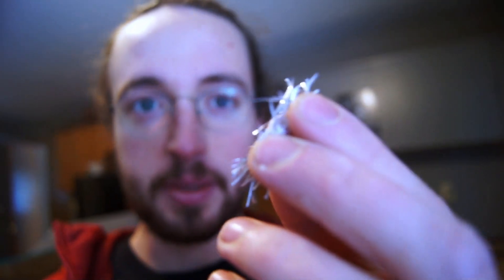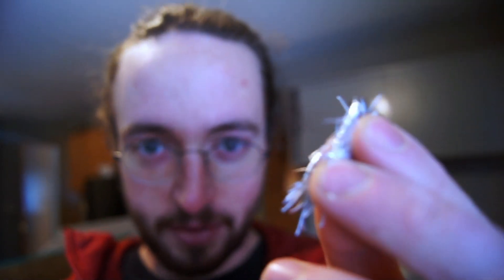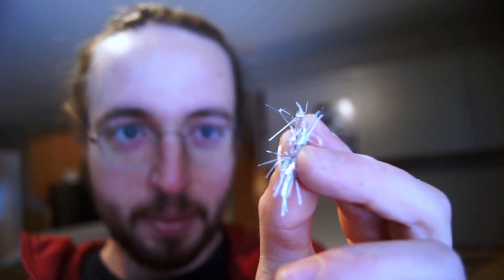I sped up the spindle speed when I heard that chatter — I thought it might help. Didn't. But they were making pretty decent little chips. I vacuumed up most of them but left some here for you guys to look at. They look pretty good. Some of them thinned out after I turned up the spindle speed — that happens because if you just turn up the spindle speed you also need to increase your feed rate, which I didn't, so I had some chip thinning. But the chips at the beginning especially look pretty decent, so I'm pretty happy with all this.